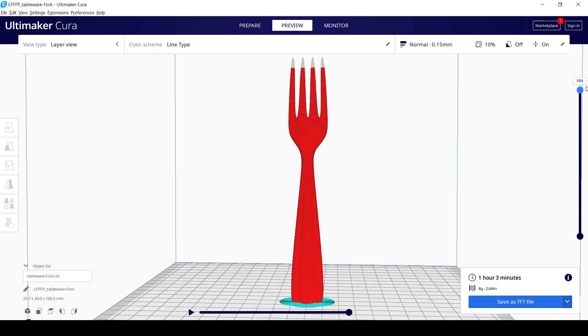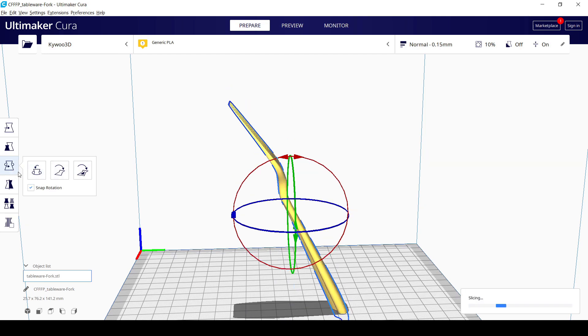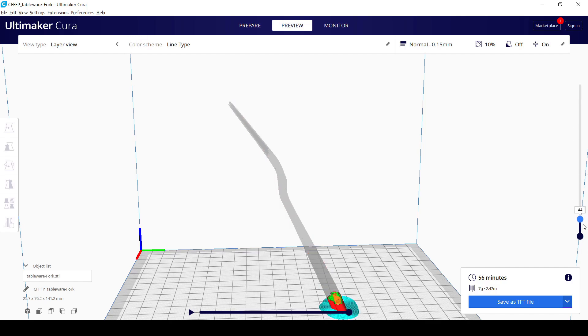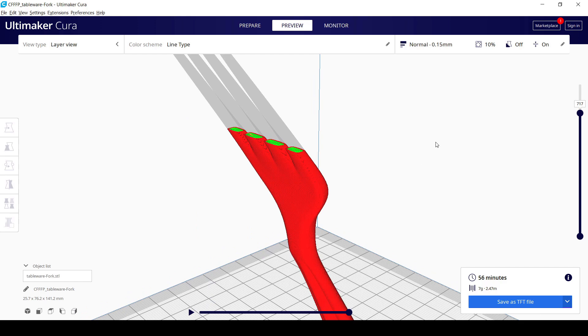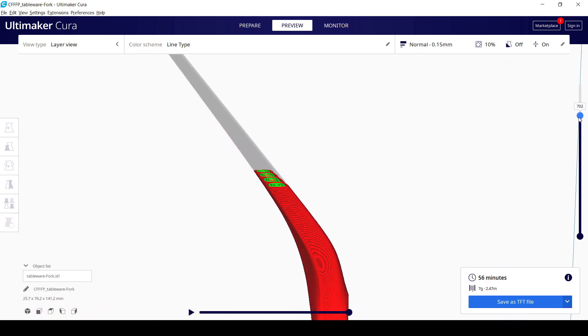The same problem exists for the fork. Maybe I could print it flat and maybe I could even use a heat gun to shape it into the traditional shape of a fork. But I decided that the best thing to do would be to stand it up — to give it a broad enough base that it will sit on the build plate and then just print upwards like this. That would allow me to put the subtle, gentle curves into it that we expect. But we're running into a problem, especially with the fork: as the layers go through like this, they're very small and very shallow and have very small contact with each other. So to combat that, I tilted the fork and the spoon and the knife just about 30 degrees — enough that the curve back and forth wouldn't make too heavy of an overhang, so we could still print it without supports. But now the layers are going through at a diagonal angle, like French bread, to increase the surface area that you can spread butter on — or in this case, to adhere the layers to each other.